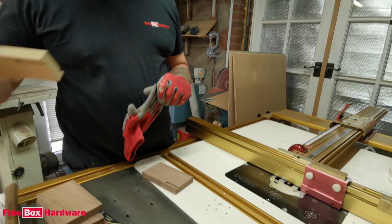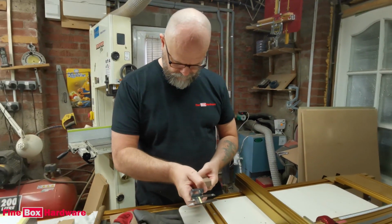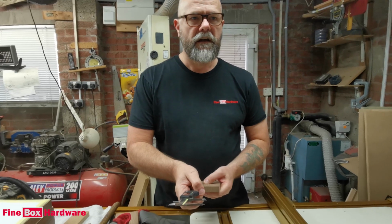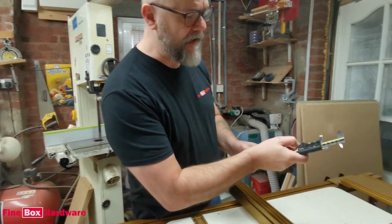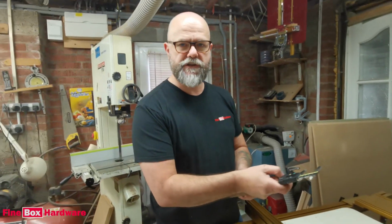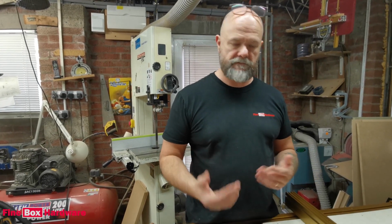Okay, remember guys, we're going with the rotation, so make sure you have the piece securely. Okay, so what we want to have is 38.65. That's okay, leave it on. Okay, and what we've got is 38.41. So we're at about 2.4. And that was using the same block. So that might show you guys if you're having bad misalignment.